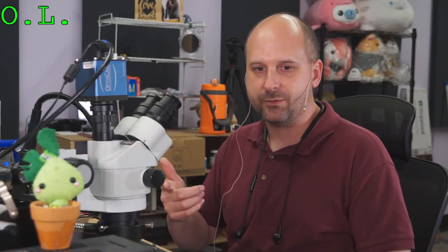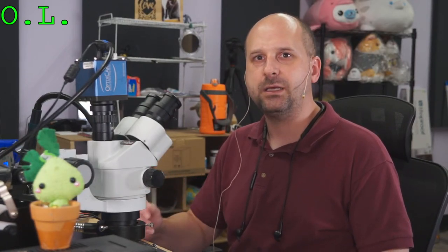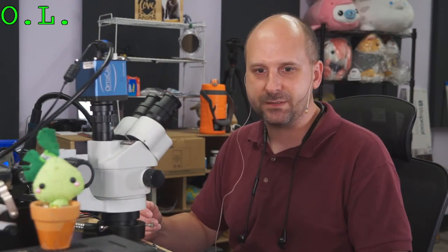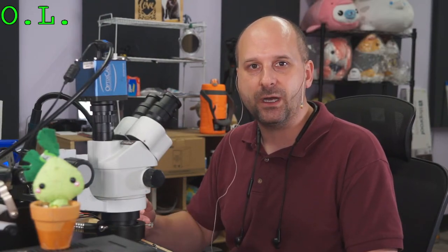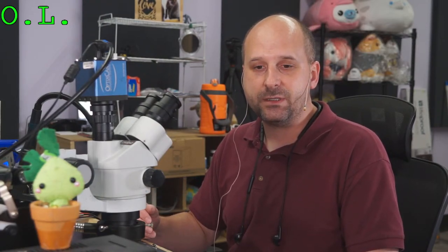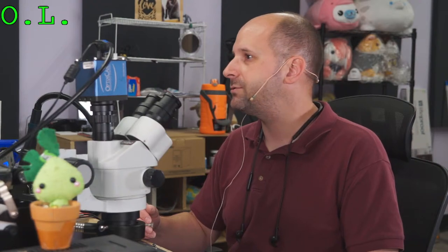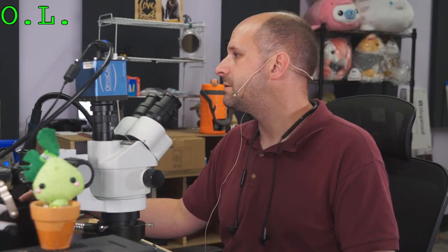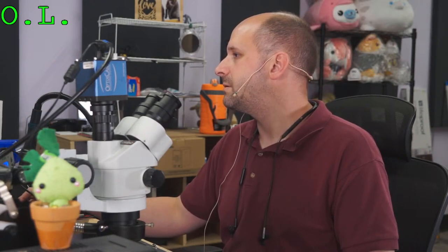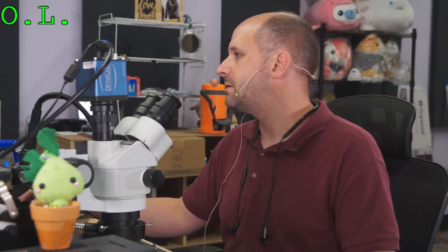And if you're in the business and you get these machines in completely clean, nothing wrong with it, seems fine, only it's not turning on. You get quarter fan spin sometimes. Sometimes you get only 150 milliamps and it just doesn't turn on. Take a look at these ISL chips. The two, what's the designations? It is U7710 and U8110. So both of those chips, they die.